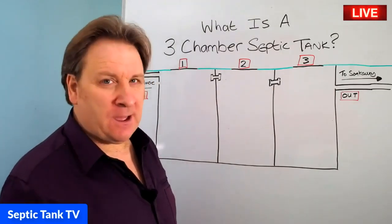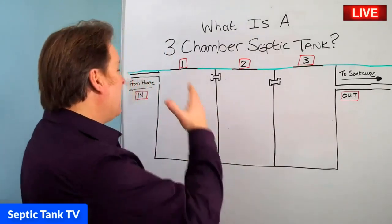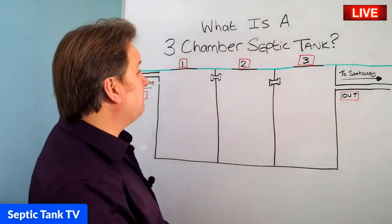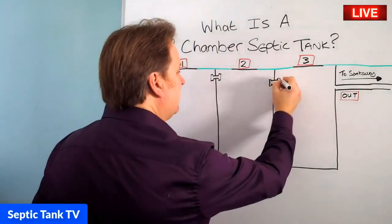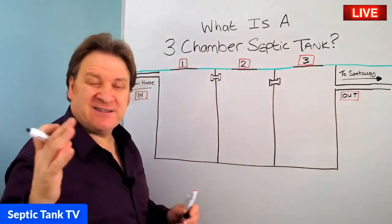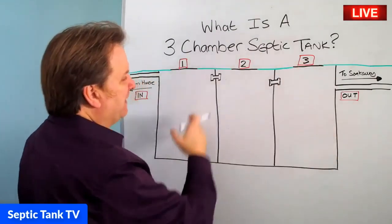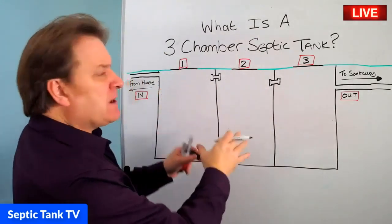What's unusual about a two- or three-chamber septic tank is this: most septic tanks, especially today, have only got one chamber. But go back 50, 60 years ago and most septic tanks had two or three chambers. So that is what a three-chamber septic tank is — it's basically a concrete or brick-built underground tank, and inside it has got brick, concrete, or breeze block partitions. It would have been one big tank and then they just divide it into two or three sections.